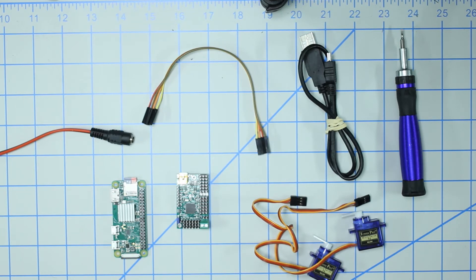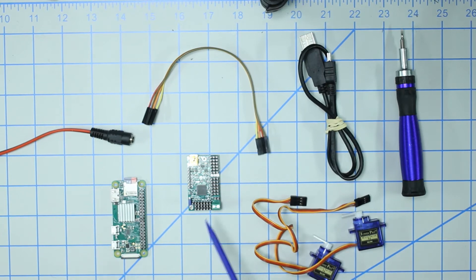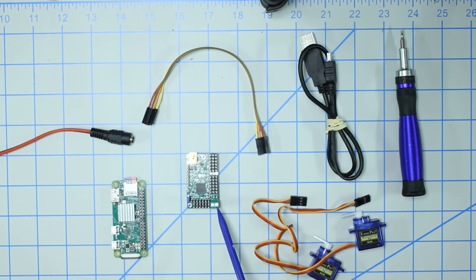It's provided by the website pololu.com - links for all these parts will be in the description. If you go onto the site you'll notice there are several different versions of this servo controller. This is the 18-channel version, meaning you can hook up 18 different servos. The site provides 6, 12, 18, and 24 channel servo controllers, so depending on your use case you can fine-tune how many inputs are needed. It's also really well documented.